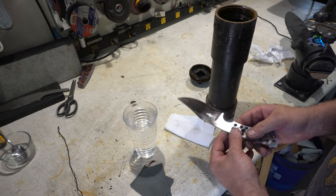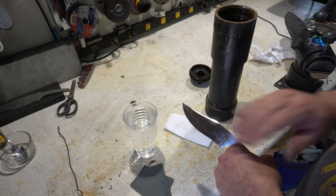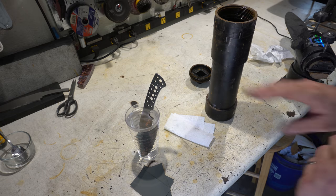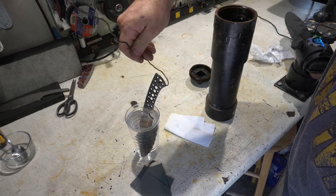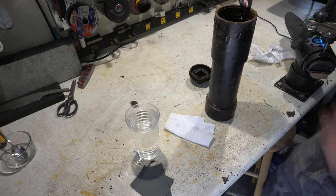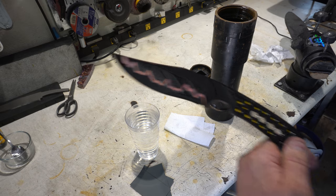I'm ready to etch this blade. I've now got it hand sanded to 1000 grit, cleaned it off with acetone, and now it's going into the ferric chloride. This is a special batch of ferric chloride I use just for copper knives, because the copper will contaminate it and turn other blades a copperish color, which you don't always want. I'll probably leave it there for a few minutes and then check it. You'll see what tends to happen — the copper will start to bleed, and that's when you need to take it out.